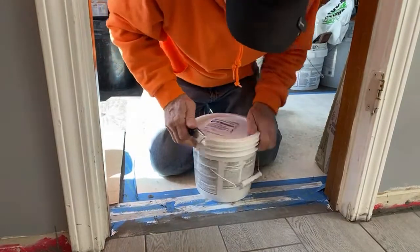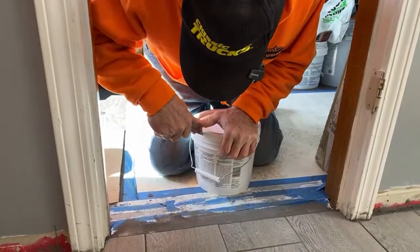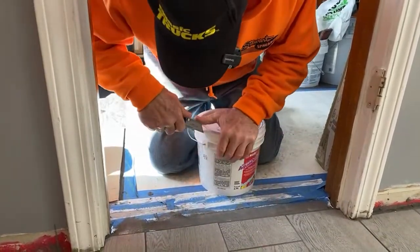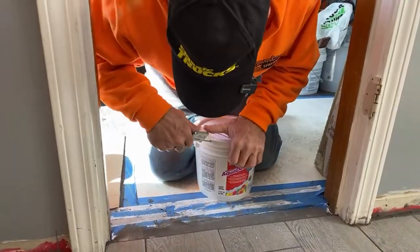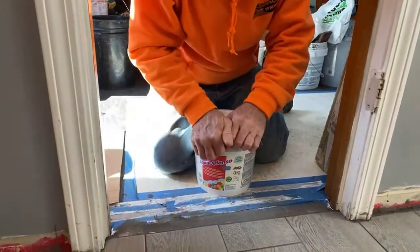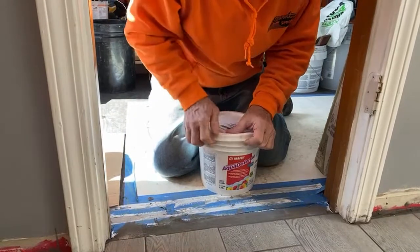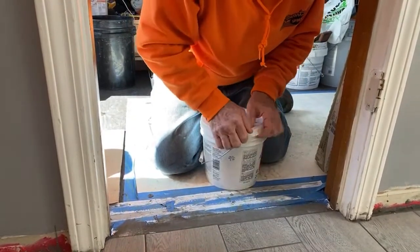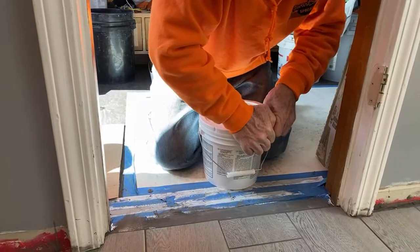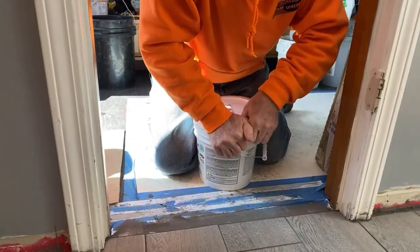So what we're doing today, boys and girls, we are waterproofing the walls and pan. Even though we use Schluter Kerdi products in here, I'd like to point out that thin set is a perfect sponge for water. Even though we have used bands in the curb of our shower, Schluter wall material, bands in the corners, it's still porous. I was asking John the other day, you've been in the concrete business for how many years now? Many. Since I was in 8th grade.